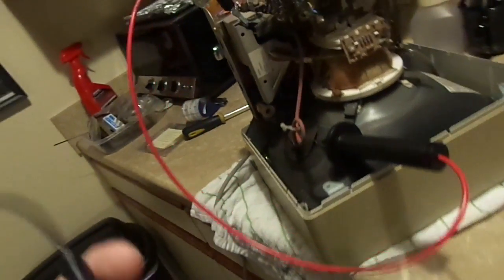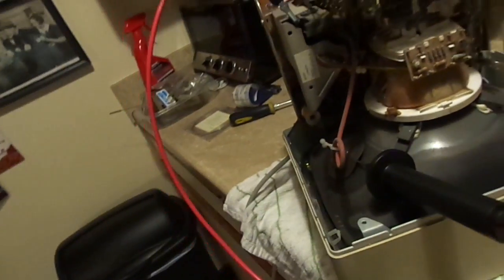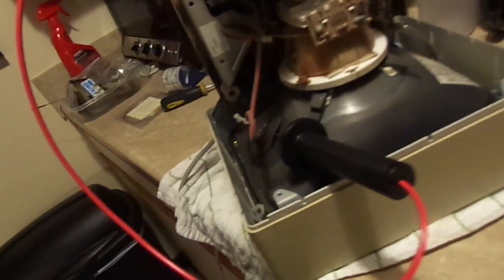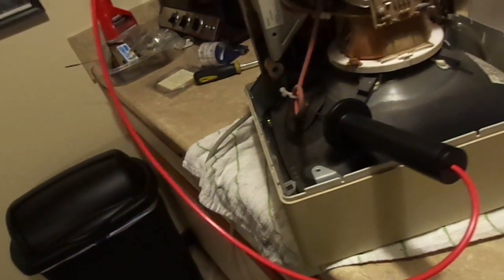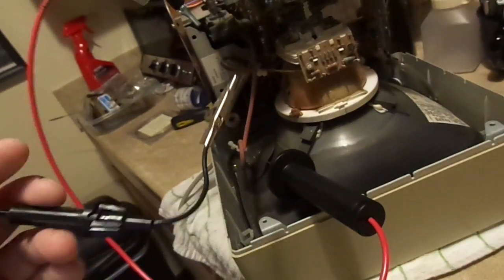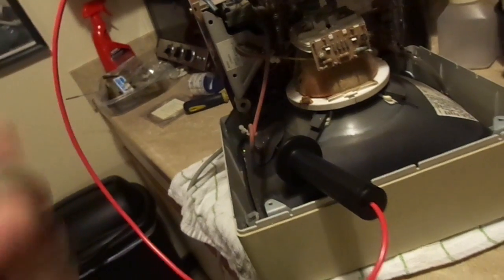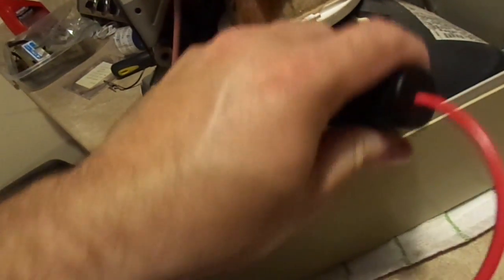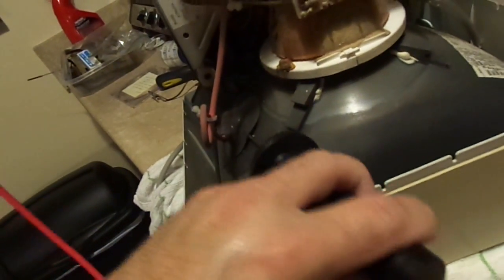This kit also includes this little doohickey here — it's designed to prevent the CRT from recharging itself, because sometimes voltages can move from one component to another and regenerate enough current to zap you, not kill you. This is what you're supposed to use to ground the cap to the chassis while it's being worked on. So we know we've got it contacting the clip — we're going to take this cap off.